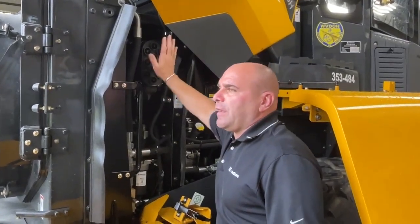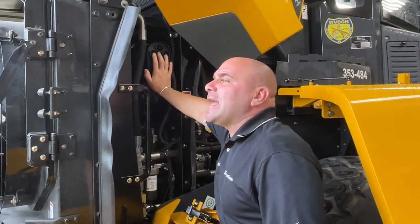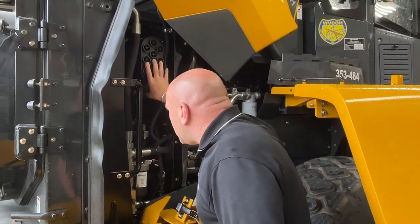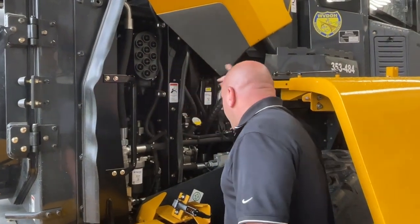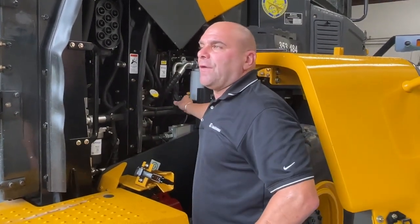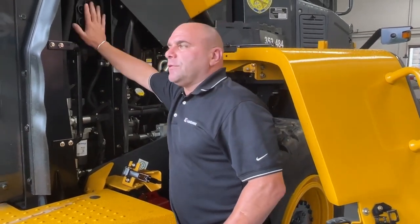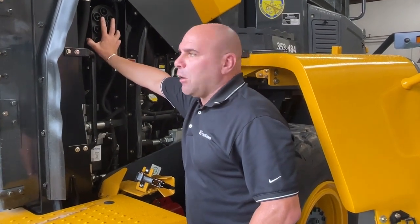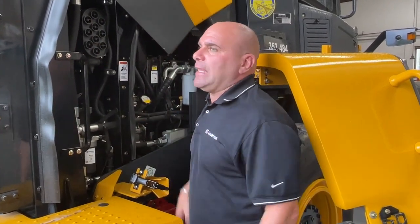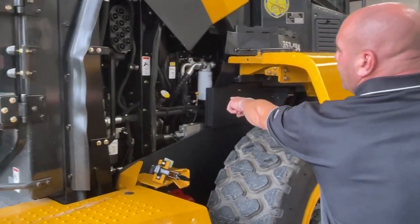Manufacturers with the new air cleaners are saying you cannot blow them out. Go ahead, sir. Does it have a block heater? It does not have a block heater, unless new ones put a block heater on. Bo? I think it's outside. Okay, I'm not sure. For some reason, I think that Bo put a block heater on, which he does. So all the 835s and probably 856s for the state get block heaters. Okay. Again, the air cleaner manufacturers, whether it's Cummins or Perkins, are saying you don't blow them out. They're throwaways anymore. Because now they're more of a honeycomb, and you just can't get them clean anymore. Okay. Again, level checks, fill point, block heaters are right there.